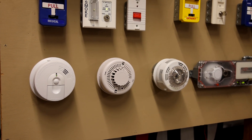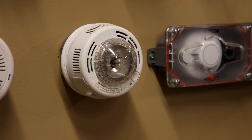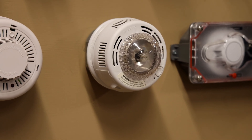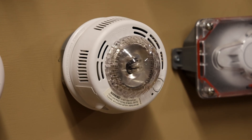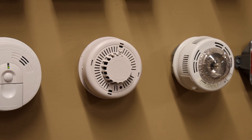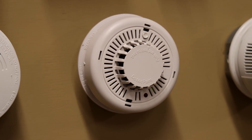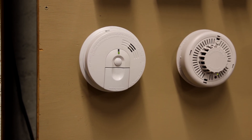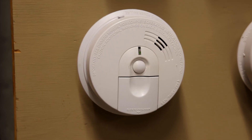On the board right now we have one FireX smoke alarm and two First Alert smoke alarms. The one on the far right is a First Alert 7010BSL 177-candela hearing-impaired strobe smoke alarm, meant for hearing-impaired occupants so they can see the strobe flash and recognize there may be a fire. To the left is a First Alert 770LBX dual ionization photoelectric smoke alarm — these are no longer in production. And to the left one more time we have a FireX I4618 series ionization smoke alarm; these models are extremely common.